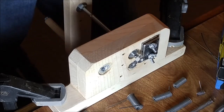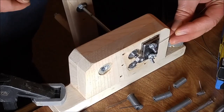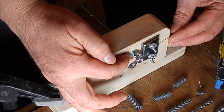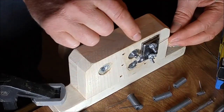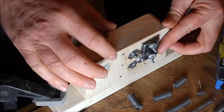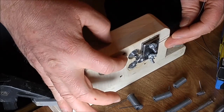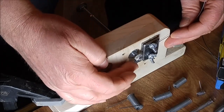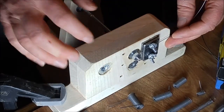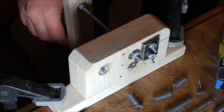Here is the process to make the spring in more detail. Take a piece of cut wire and feed it through the metal alignment plates — there's a notch in the plates the wire goes through. Adjust the crank handle so that the notch on the bolt is in line with the notch on the mounting plate, so the wire feeds through straight. Set the amount of end length of wire that you want — in this case I'm just going to make the end of the wire very short — then tighten down the nut onto the wire, which locks it onto the bolt inside the notch. Then turn the crank handle clockwise.